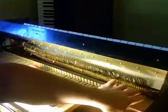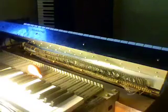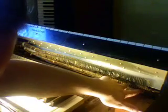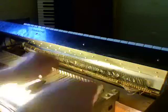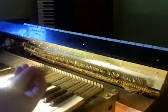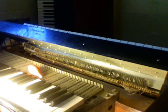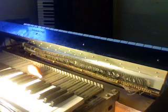That took longer than I'd like to admit, but the E works. The best method is to kind of hook the wire a little bit, put it around the wires already connected behind it, get a pair of needle nose pliers, pull it up around the terminal, and twist it over. That way it's in the exact same position as the rest of the contact wires. It's tiny wires — it takes a bit of patience. The first six lugs only have one wire connected to them; the next ones will have two, and that's part of the foldback. Let's get to it.